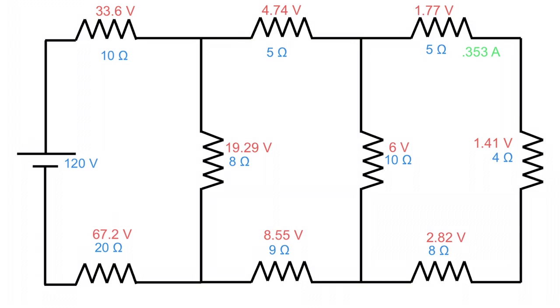To recap: add three resistors, squish with the parallel one, add three more resistors, squish again, add three more, get a circuit current, find this voltage, this voltage, this voltage, then spread it out. Determine each branch current, then find the voltage drops across each individual resistor. Keep spreading it out until you have all your voltage drops. I'd suggest drawing out each step and walking through it step by step.